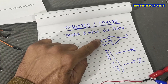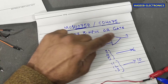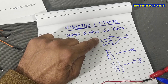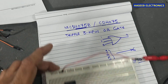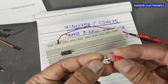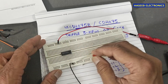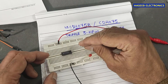If any one input pin is high, the output will be high. If all inputs are low, the output will be low. If any one or all inputs are high, the output will be high. To demonstrate this, I will use an LED — connecting the shorter lead to ground and a one kilohm resistor in series, and testing one gate at a time.